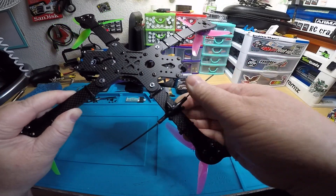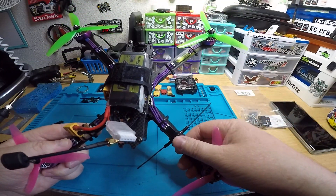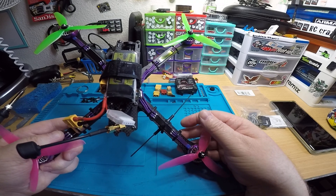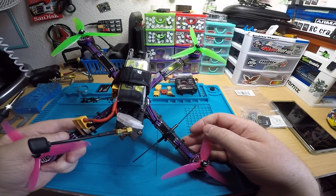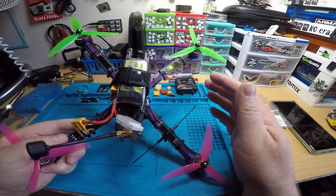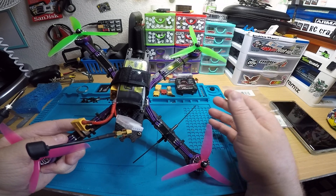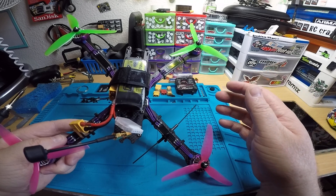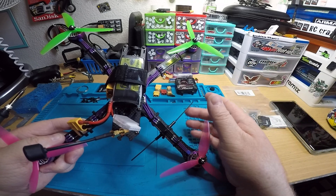The Crossfire antenna is mounted on the arm. I removed all the heat shrink that was on the race wires and re-soldered all the joints, then conformal coated them, so they should be fairly waterproof. One of them didn't have any heat shrink and I didn't have a match, so I figured I'd just take it off all of them — that's what race wire is really meant for anyway, to allow quick and easy motor swaps. Now they're all open, but the conformal coating takes care of waterproofing.